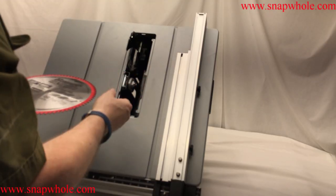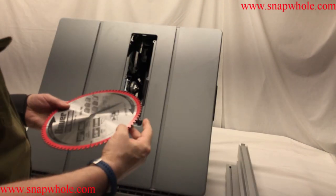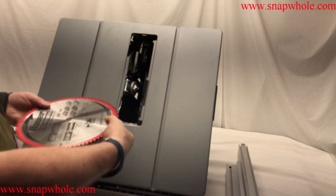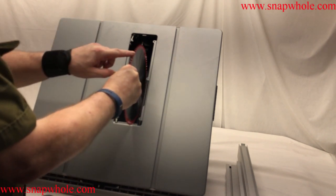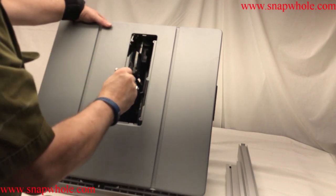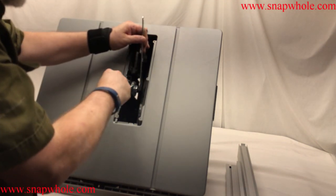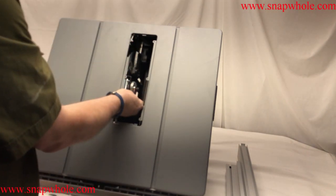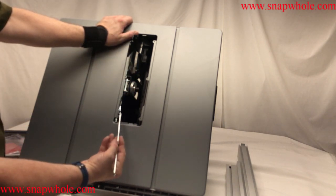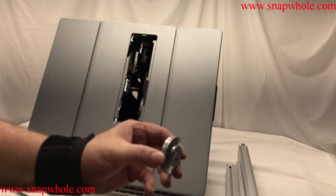You have to raise the mount all the way up. Raise the mount by turning this. Works good. And the thing to remember is the point toward the front of the saw, because the blade turns and goes down in the front. Cuts down. So we have an arbor nut. Most of the time that's going to be tight. This is the first time, so it's not. If it's tight and the motor turns with you, then slip this on the inside of the flange to loosen it. So if you ever have any doubt about what way to turn, put the wrench down in there and pull toward the front of the saw, and that'll loosen that.